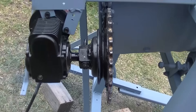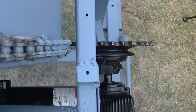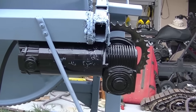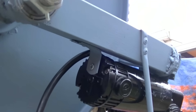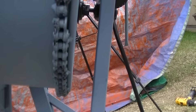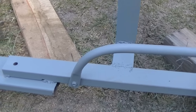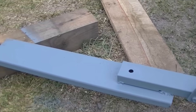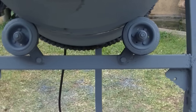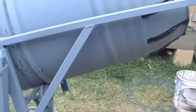The RPMs end up being perfect for this. I made a bracket to support the motor, got it all lined up, and the teeth rotate the barrel. The center of the barrel is supported by a one inch threaded rod welded to the center, but the actual torque applied to the barrel is through the chain, and the weight of the concrete sits on the wheels underneath. The bearings are only holding it centered and keeping the drum from falling off. I added feet to the legs for more stability when you put weight on the front, and a handle to allow tilting.